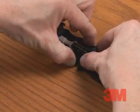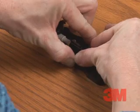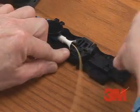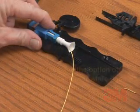Press the release lever to allow forward motion of the funnel. Push on the ears to move the funnel forward and actuate the buffer clamp. Lift the fiber clamp and fiber covers to release the fiber. Lift the element actuation button.